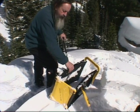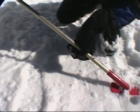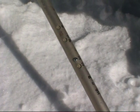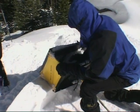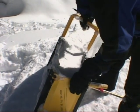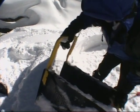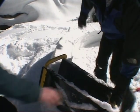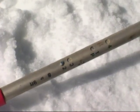Okay, so he's reset the form that's on the wall. I lift it up in the air, and then he takes and moves it to hole number 3 for one block. It actually needs to go to hole number 2 eventually, but we'll kind of cheat here and average it out a little bit. There, he's able to push the form down a little bit. Okay, now I hold it again, and he puts the little pin into hole number 2.